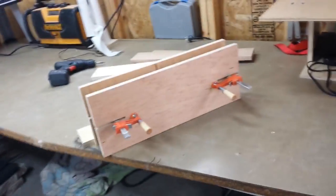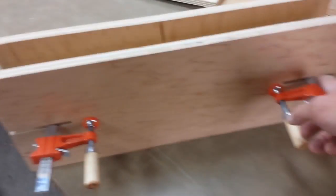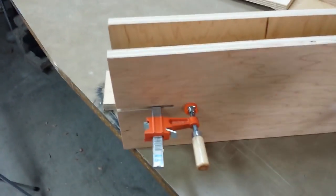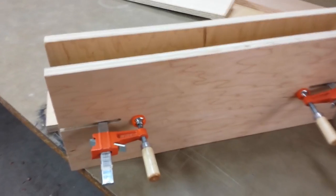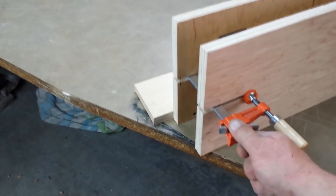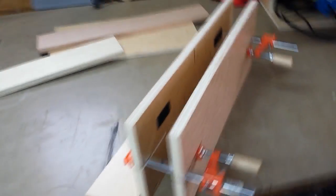You're looking about 8 inches tall on this particular one. I've got about 20 inches wide is what I made it. You've got to keep in mind that these are coming in 4 inches also, so you're taking out 6 inches overall — you've only got about 14 inches in there. It's probably wide enough for anything I do. But you can adjust it by sliding your clamps out a little more towards the edge, so you could go wider. That's it — hope somebody finds this useful. Thanks for watching.